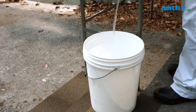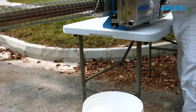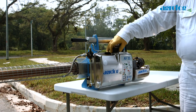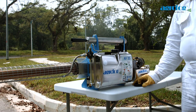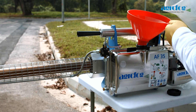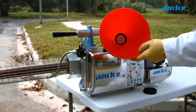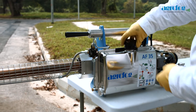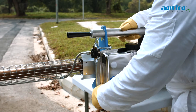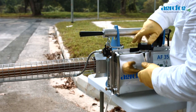Solution System. Empty the solution tank. To flush out the solution line, perform the following: fill the solution tank with 500 ml of water. Rinse by shaking the unit thoroughly. Unscrew the tank cap while emptying the solution tank.